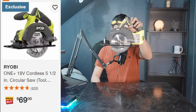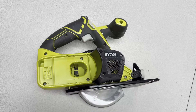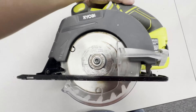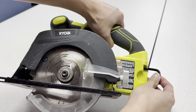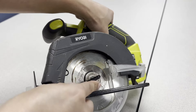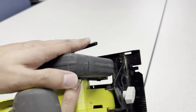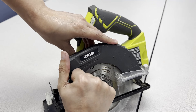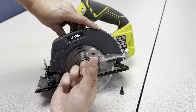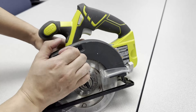Lastly, we have this cordless 5.5-inch circular saw. You're going to want this if you want to cut wood. When I was doing construction, I would use this a lot to cut the subfloor, some 2x4 wood, and even metal nails. This tool uses a 5.5-inch blade. You can easily change it — there is a hexagon key on the back. Right here is the screw holding it. Before you can twist the screw, there's a button you need to press. Keep holding the button while you turn the key and it's going to push in — now the blade is locked. To loosen it, turn it clockwise. To tighten it, turn it counterclockwise. That is how you change the blade on this circular saw.